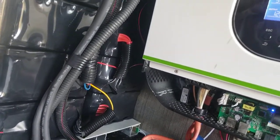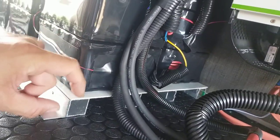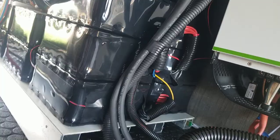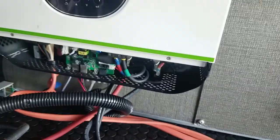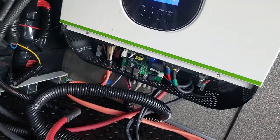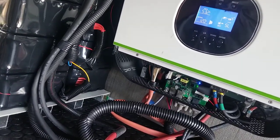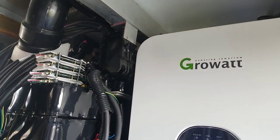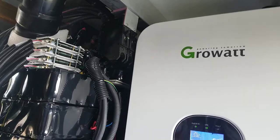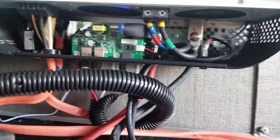That trigger in other systems is used to switch things on and off, but in this case, it's just designed to be loud enough to let you know that this compartment is flooding. But you would have a full inch of water up here, and there are two drain holes. Additionally, the water would just drain underneath this, to another hole on the other side. So the odds that you would have an inch of water are pretty low, but we're just trying to get an extra alarm. It's not necessary to trigger anything off, because we're just looking for the redundancy. We have already factored in what would happen with the water, and we're just trying to trigger that alarm in that case.